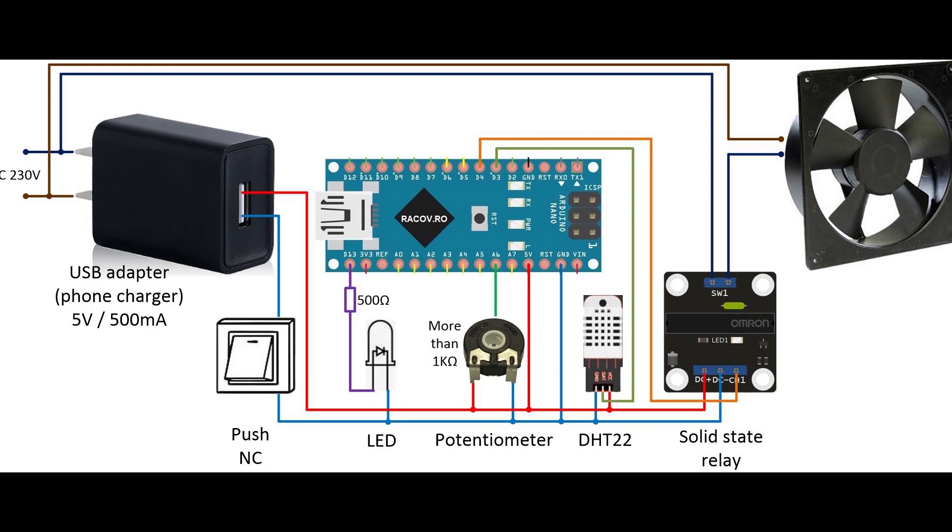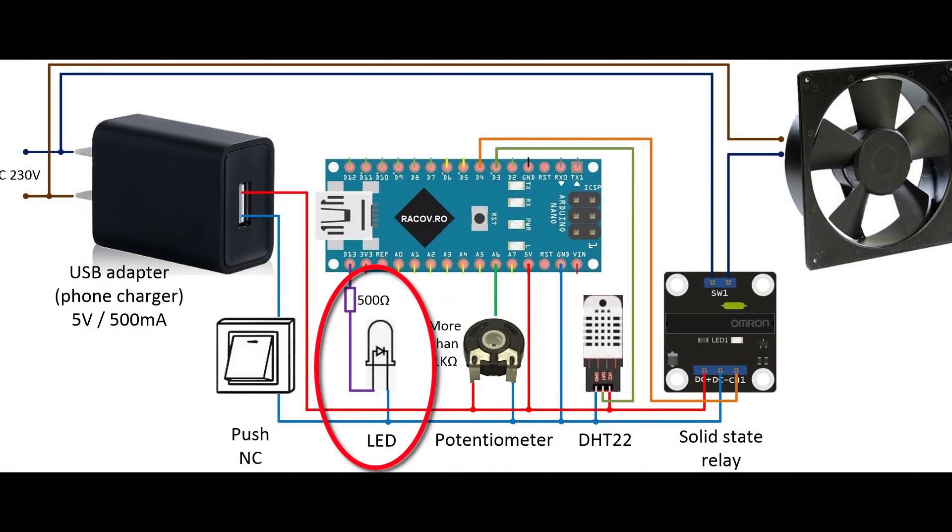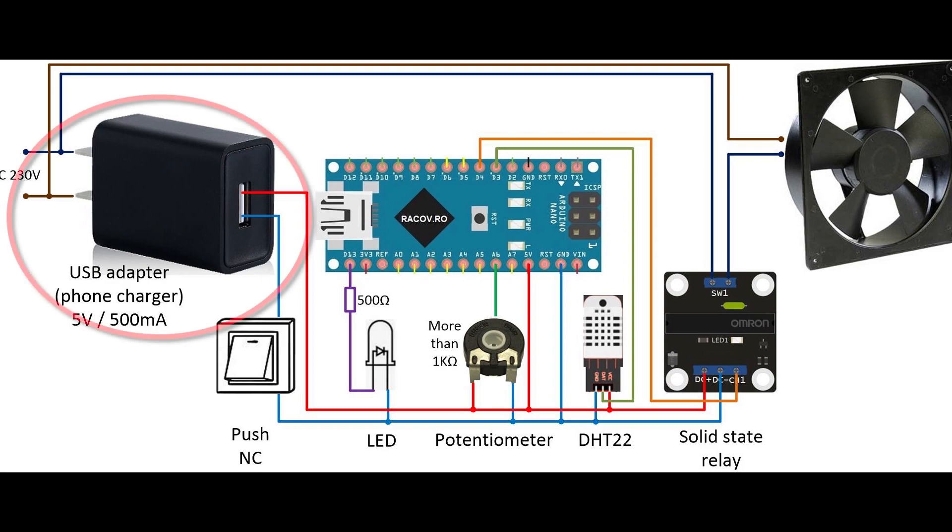The manual trigger occurs when the controller is reset. I wanted to put the manual trigger delay at boot time, so if the Arduino freezes — and it will once in a while — the manual activation will unfreeze it. There is also a status LED, blinking slowly to show it is alive, and fully lit when the fan is engaged. The manual delay is set at 15 minutes and can be changed in the code.